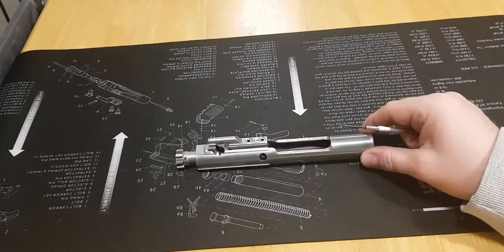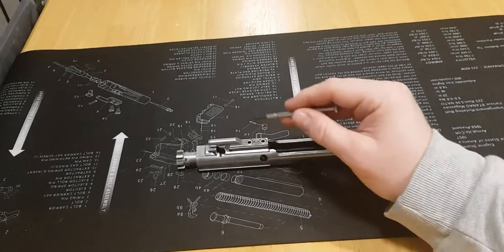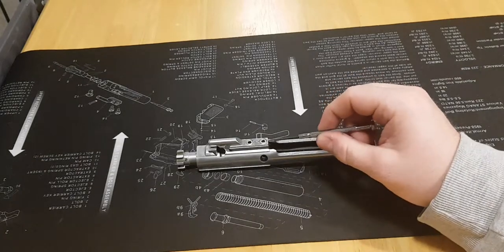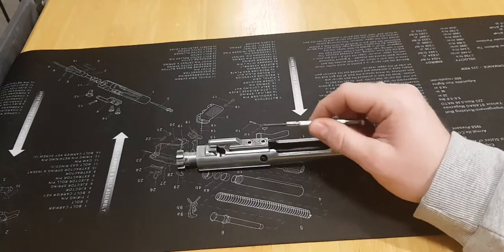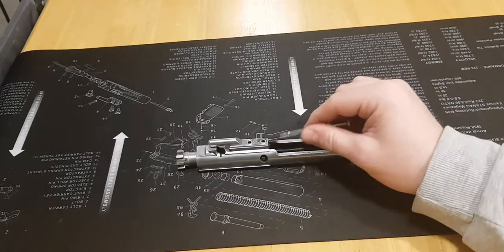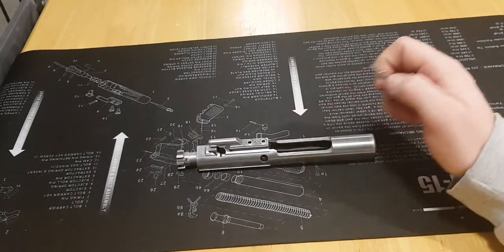There will be very subtle differences. However, if you're in the UK like I am, it's possible that your bolt carrier assembly won't have the gas key. The gas key is essentially part of the semi-automatic functioning of the rifle, and so on straight-pull rifles in the UK it's redundant. Some manufacturers don't bother to install it, some still do like this one, but others don't. So if it doesn't have that part, don't panic — unless your rifle is a semi-automatic one, in which case it definitely should have that part.